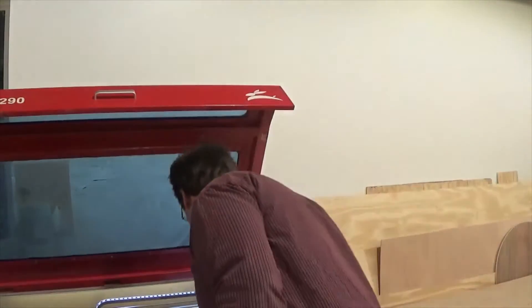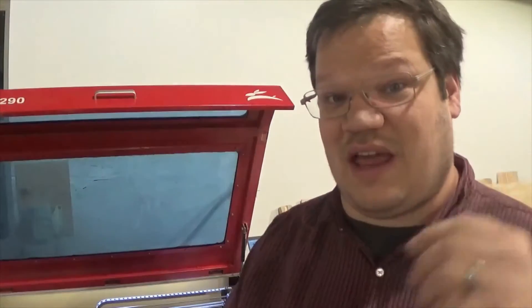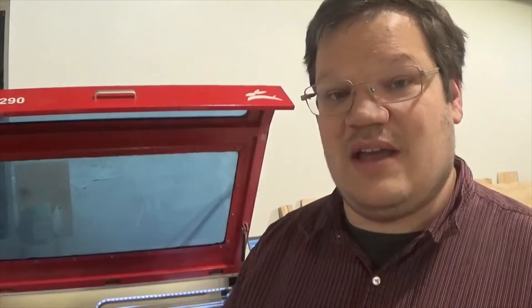It's nice when I press record, isn't it? So you guys get to watch this time. This is a really light engraving at 45% power — we could bump that up and go a tiny bit deeper so it color fills a little better. But keep in mind, if you increase power or slow down your laser, it's going to engrave deeper — you're essentially chipping the glass away, so your detail may not be as good; it'll be rough rather than frosted. With these settings, we got a nice frosting.